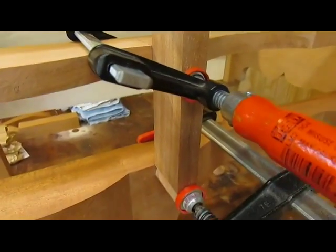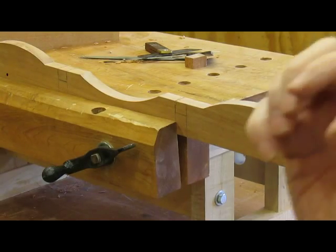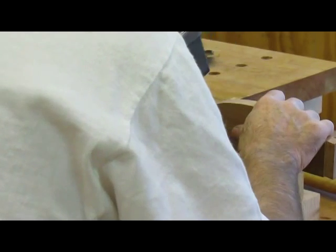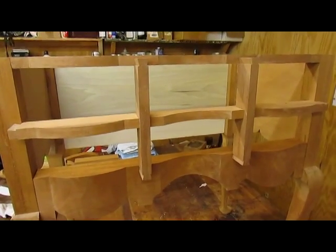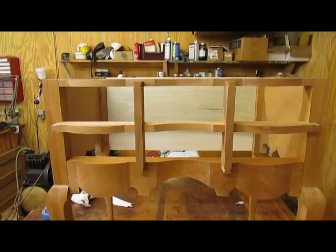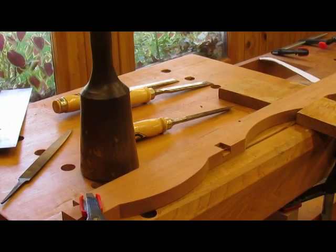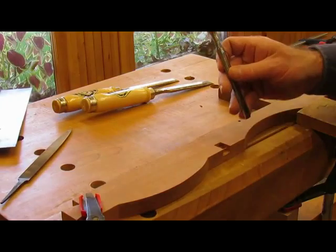So that's what we're going to cut out next — I'm cutting out the recesses. I've cut the cross grooves and we're all lined up here, ready to cut the dovetails into the apron and the top rail. I'm chopping out the dovetail on the top drawer blade for the drawer separators.